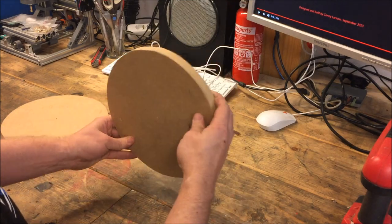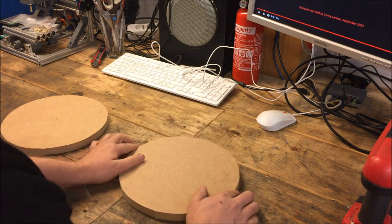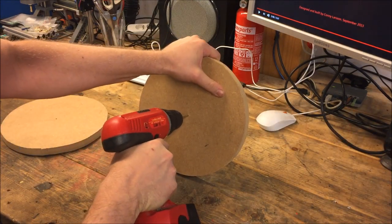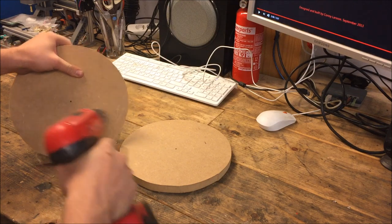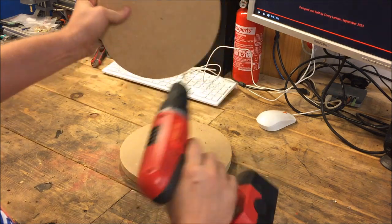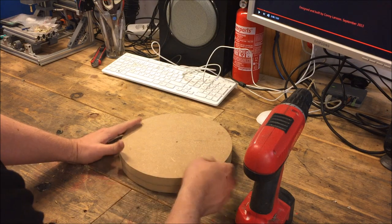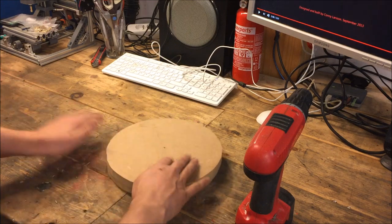Unfortunately, I don't have one of those that you just put it into and which spins and you can just cut it off, so I'll have to invent something that does that for me. I'm just going to drill this hole and then we'll see what I can do with that. Let's just do that immediately. There. Now I'm thinking if I should just somehow attach a power tool, so it can spin. A threaded bolt, a threaded pin, and some nuts, just keep it in place and put the threaded pin into a drill machine or something like that, and then just go around it at the edges with something that can carve out the excess material here, so they become nice. All right, let's do that.